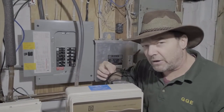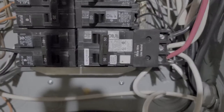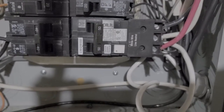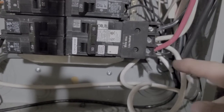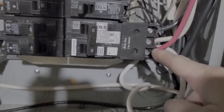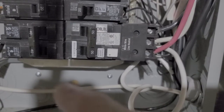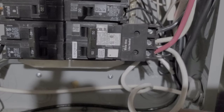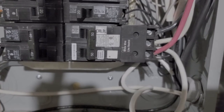You've got to remember that GFCI breaker — it's a water area, you don't want anyone to get electrocuted. Here's a close-up of the ground fault breaker I put in for the hot tub. It is a 50 amp double breaker, and you can see we've got both hots coming in on either side where they belong, the neutral from the hot tub coming in, the ground is running over to the ground bar, and then the neutral coming out of the GFI is hooked up to the neutral bar as is required.